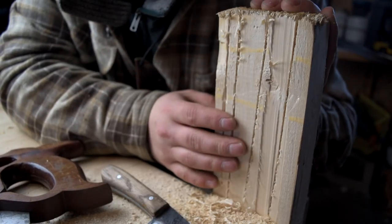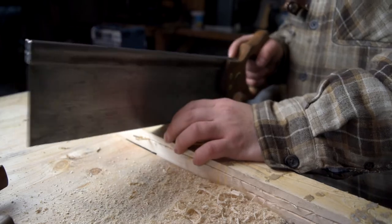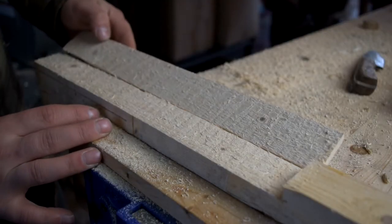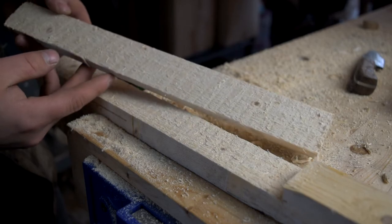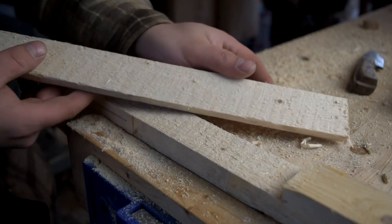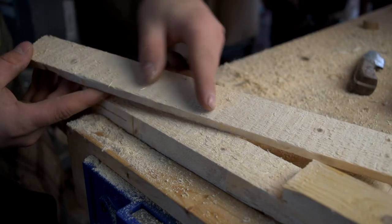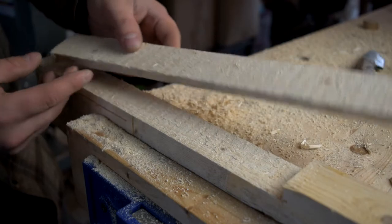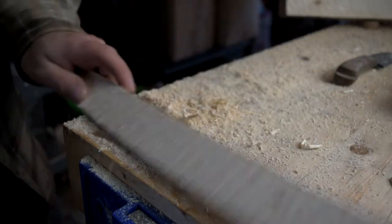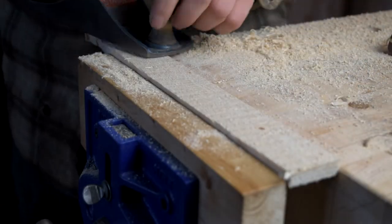Once that's done, you open it up and plane it down. Let's do that right now. You can see when we open up that cut — this is the finish we have. It's actually a pretty nice finish, nice and flat. Obviously it's a coarse cut so you have some tearing, but just look how far we're moving with each cut — those are quarter-inch or more strokes and I'm not working this all that hard. Let's give it a little bit of planing and see how quick we can get down to finish material. Let me get out my trusty number four again.